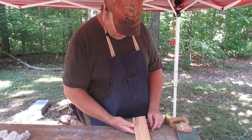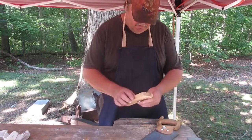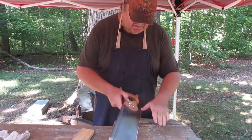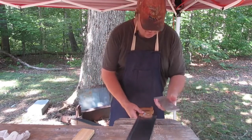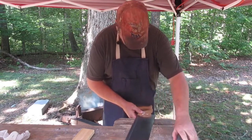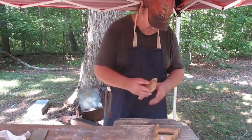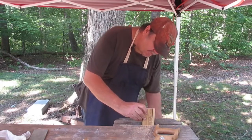that's a nice cut. This is a 1000 grit diamond plate, and when we look at these cuts, we see that the saw is veering off to this side. It's turning like that. So what we're going to do is lay this down. We're going to take this, and that's called stoning the edge. I'm going to try that. Let's see what difference that might make.